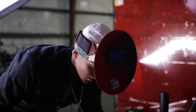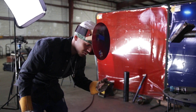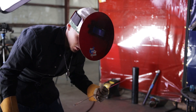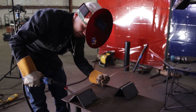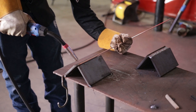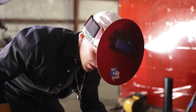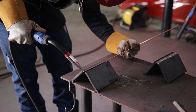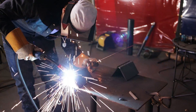Alright, so I did the padding. That method is for when you don't have any filler rod — you can also use a bronze or copper hanger. But with the filler rod it's super simple. If I have a one-inch gap, I literally take the filler rod, tack it here and tack it over here, so the filler rod is just sitting there. All I'm doing is weaving side to side, burning the filler rod. It's way easier. It's ER70S-6 and ER70S-6 — same material. If you have a long seam, just tack the filler rod along and weave it side to side over the gap.